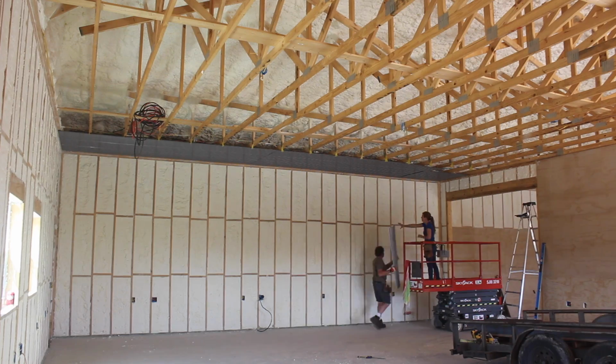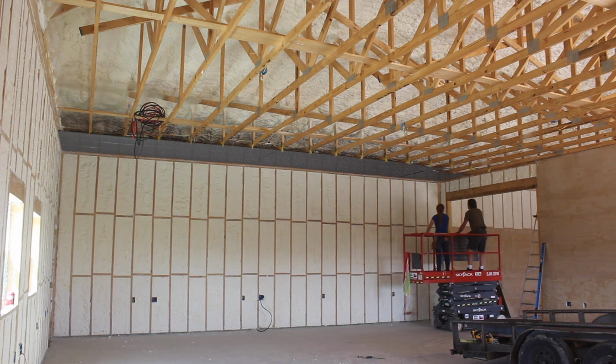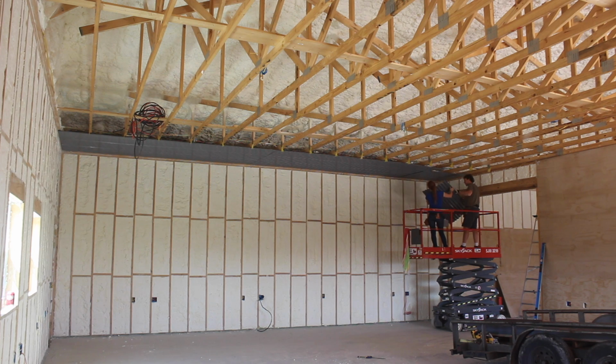So something I wish I would have put more thought into before starting is handling the very end piece, which ended up being about 1/4 of a panel. So it was 2 full sheets and then a partial to complete a full row. The seam didn't land on a truss and therefore didn't come out as clean and unnoticeable as I would like. It's also right in line with the eye when walking into this space. At the end of the day, it's fine. And since there's nothing I can do about it, I took it as a lesson, changed things up as I moved to do the woodworking side next.